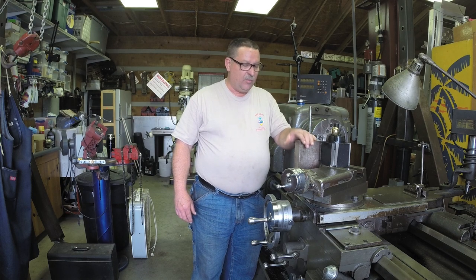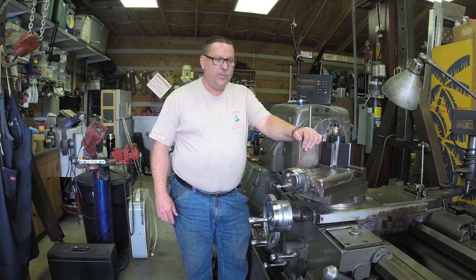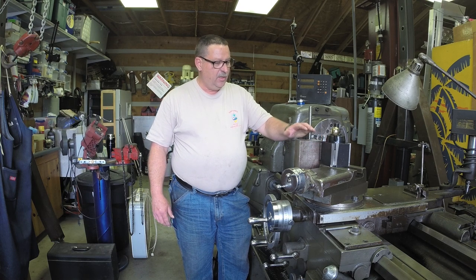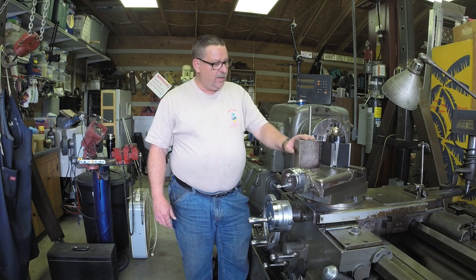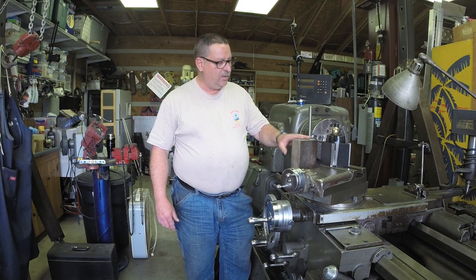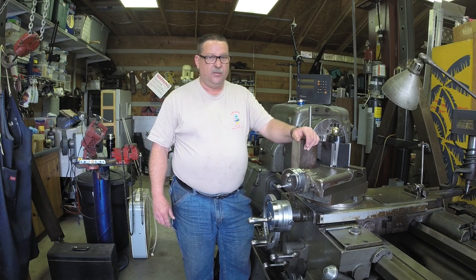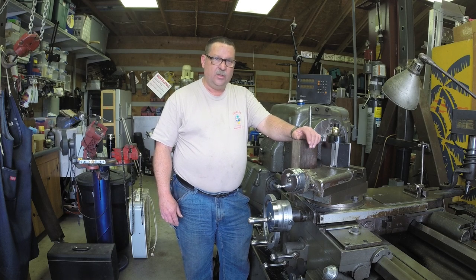So I'm going to come out and film making this, and show you how I go about doing it. I still have a couple pieces of metal that I'm going to have to find or purchase to finish this. I'm going to have to get two roller bearings because I'm going to make it a roller bearing follow rest. So when I get to doing that, I'll show you. I'm going to have to mill this down. It's not perfectly square. I don't know what this piece was used for, but it needs to be cleaned up. And then I'm going to have to cut the T-slots in it. So I'll be making some videos on that, putting them on YouTube so you can see how I do that.